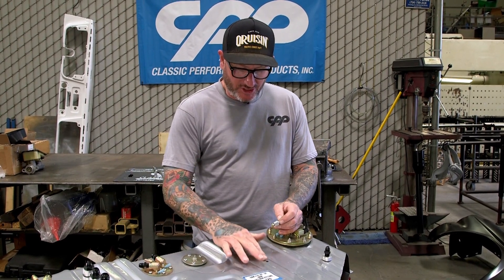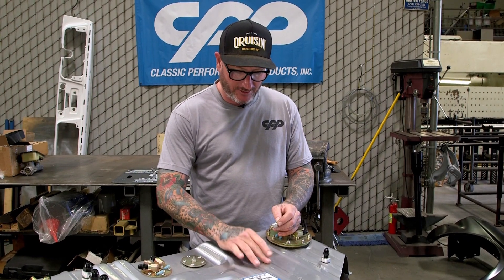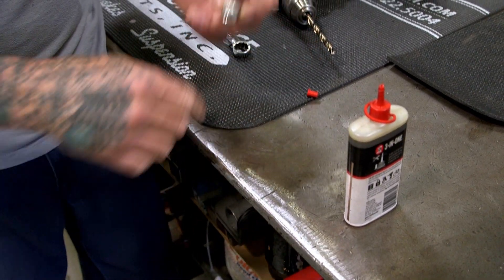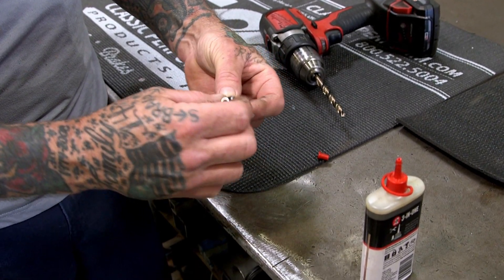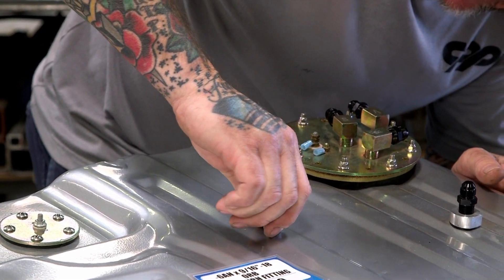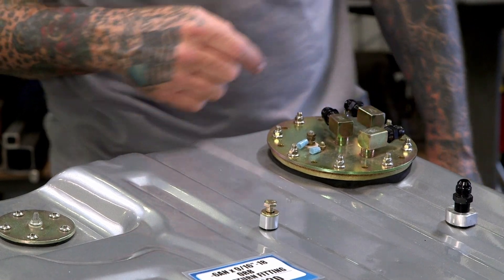It's a good idea to use an air drill opposed to something that carries electricity. With the hole drilled, make sure you have no burrs on there — if you do, grab a little file and smooth it out. Ours drilled out pretty cleanly. I'm going to go ahead and add a little bit of oil here. Put our gasket on there and go ahead and insert the fitting in. Make sure that your gasket is around the step and not wedged in between the step and the tank itself.